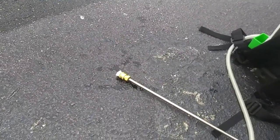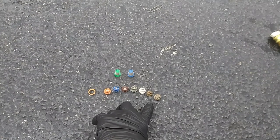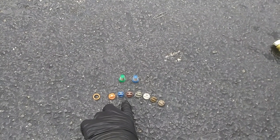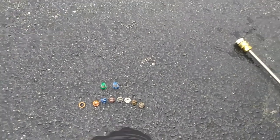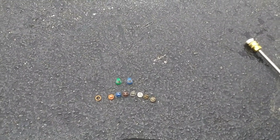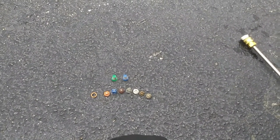As PMPs, we need to have the option of different things. We have what are known as T-jets, and these different nozzles have different volumes — all at 80 degrees — which makes a big difference when you're spraying shrubs or lawn, or doing precise applications with herbicides, weed applications, and other things.